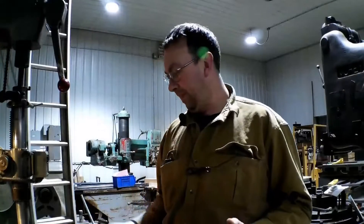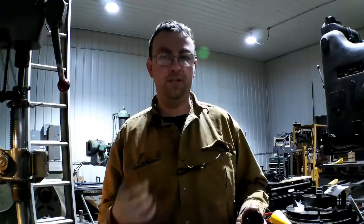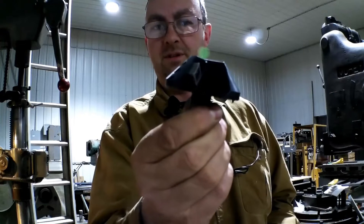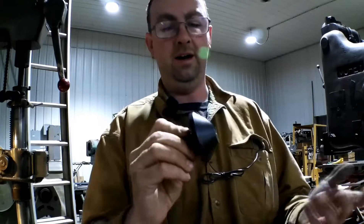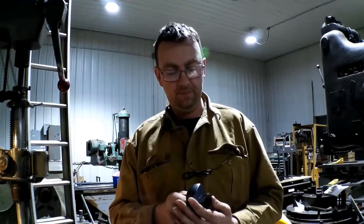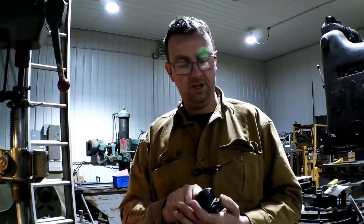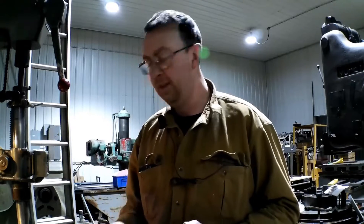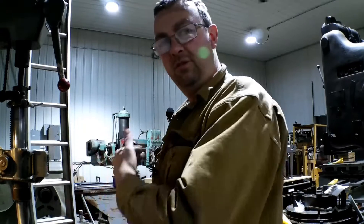We're on to the next step — we've got to put the chamfer on the hole before we go to tap it. We're going to tap these in the radial drill, but I want to talk about this little tool here. These are an indexable countersink or deburring tool. I bought these — they were cheap, really cheap, they're Chinese junk — but surprisingly they work extremely well, and for this they've been working really good. They're just a carbide insert you can change out or adjust the position. There's three sizes in the set. I've got the medium-sized one in here, and they work good. I don't understand it, but they work. So I'm going to show you this, and then we'll go over to the radial drill and get set up.